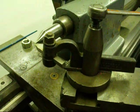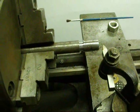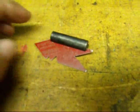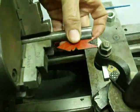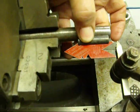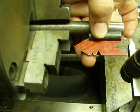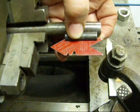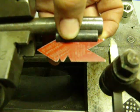Once you've got everything clamped down, move the tool up close to the work. We're going to set it with the center gauge. This center gauge has the little V-block attachment on the back, which is my favorite. Take it over and hold it onto your work, then bring the tool up until it fits in one of the little V's — that shows you are truly perpendicular to the work. If you aren't perpendicular, all of your thread geometry will be off, and all will be for naught.